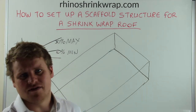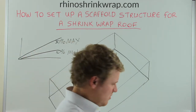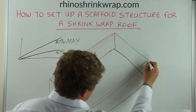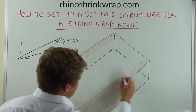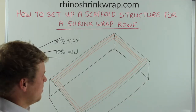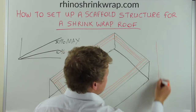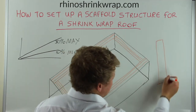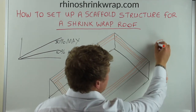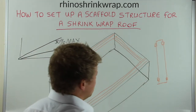With the basic outline of a structure, the first thing we would require is a triple boarded run around the perimeter of the roof. You will need to be aware that any board installed on a roof will need to be well clipped — we would advise that boards are clipped in every corner, which will reduce the chance of the board coming loose in any movement, as the sheeting will be fixed to these boards in places.